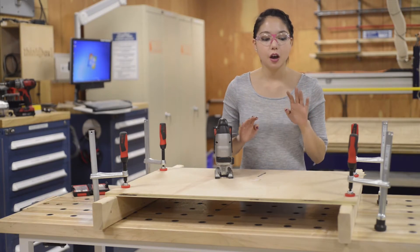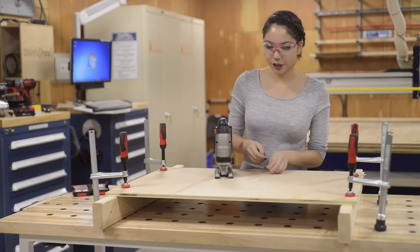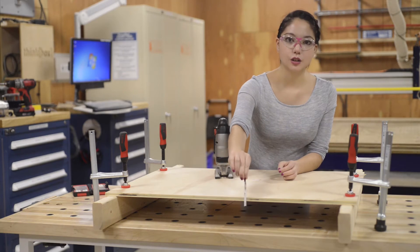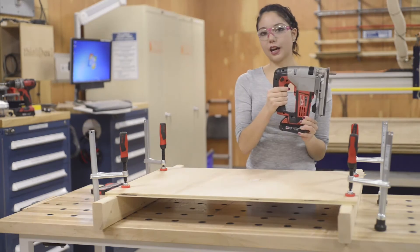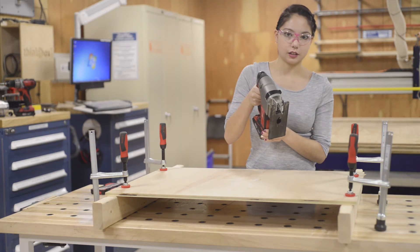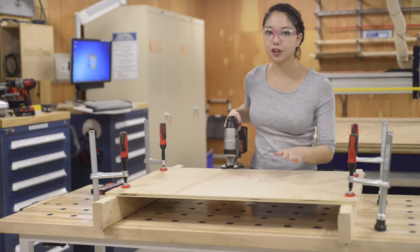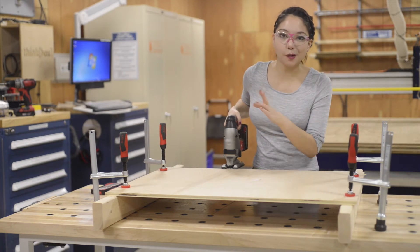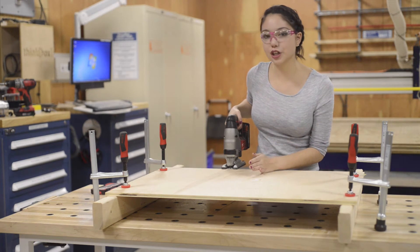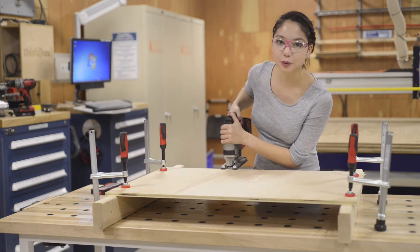As you can see here, I've clamped my wood to a table. Always be sure the blade is short enough that it won't be a problem. Right now I've got the jigsaw locked, so I'm going to unlock that and now I'm safe to go. As with all saws — the circ saw, the miter saw, the jigsaw — your saw blade should be going almost at full speed before you make contact with the wood. That's to ensure that you don't send the saw blade flying if you're jammed up against the wood when you start.